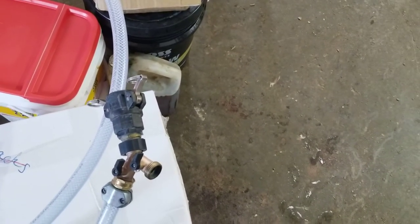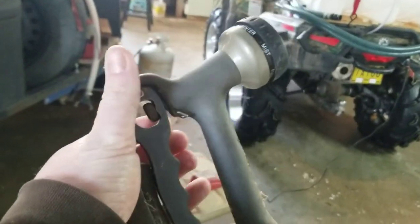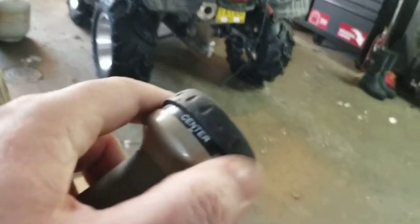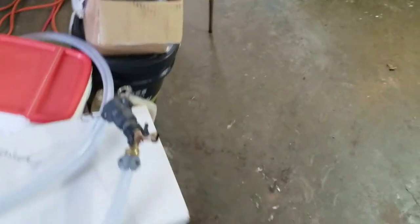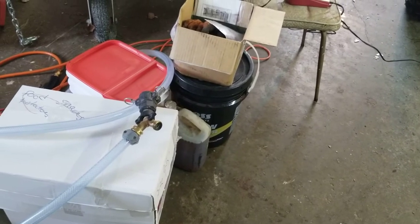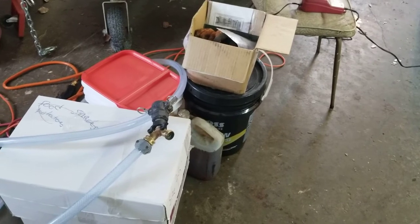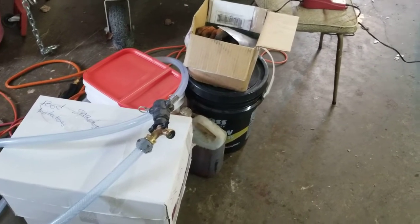I've got a plain train nozzle on it — you can get these for $10 to $20. I always have it on the straight bore setting with a click on/off. I've got a gated Y on there. I might also do a pump-to-tank recirculation line so if the pump has to run for a while it can dump back to the tank without cavitating.